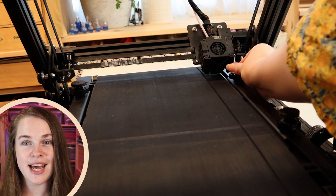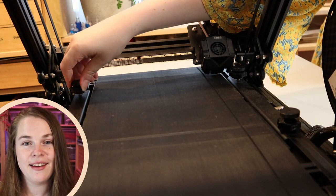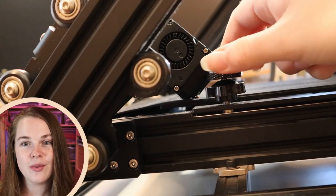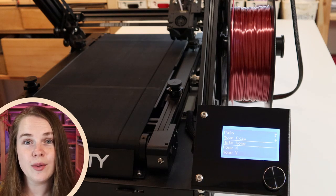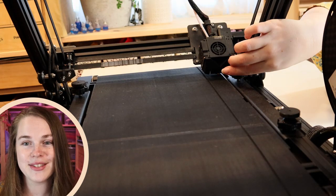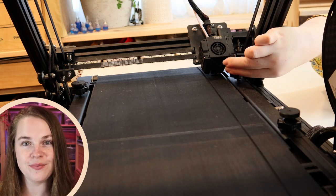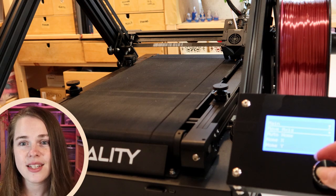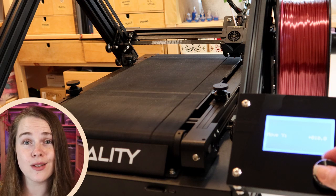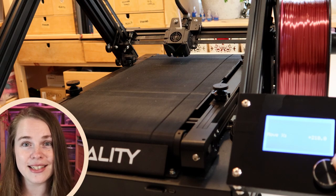Then flip the machine back around to the front and level at the back of the machine, lowering it all the way down by first unscrewing the knobs. The knobs actually unlock with the bottom one, then you can use the top one to move the height of the bed — you want it all the way lowered down. Then home the printer again because we changed that optical sensor at the back, and then bring the bed back up so it's just touching the nozzle. When you have the right spot, lock it back in with that bottom nut. Then move the machine over to the other side by first lifting it up 10mm on the Y-axis, then across the X-axis by 210mm, then back down 10mm by Y. The reason we lift it up is so it doesn't scratch along the bed in case leveling is really off — we don't want to damage that bed.